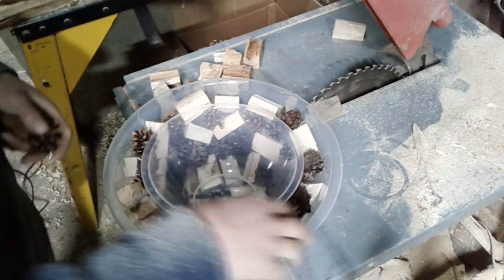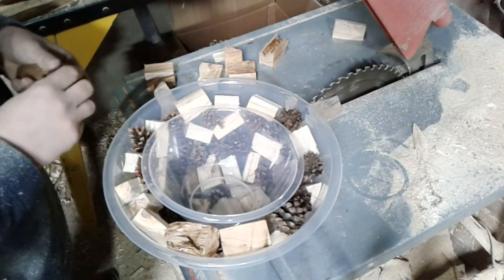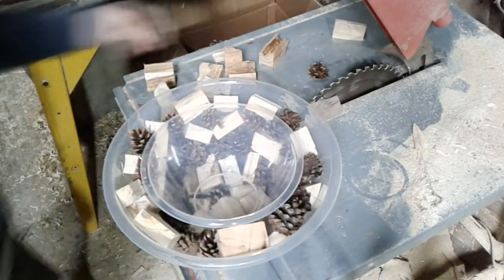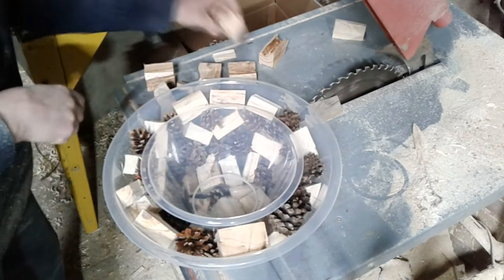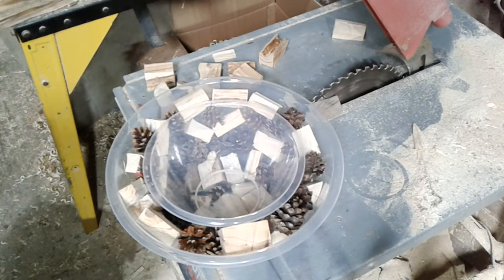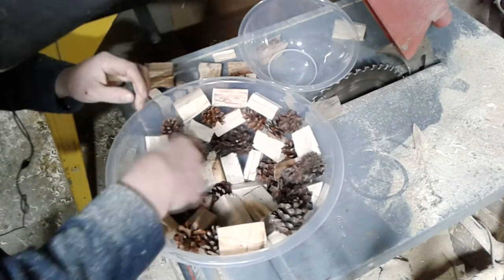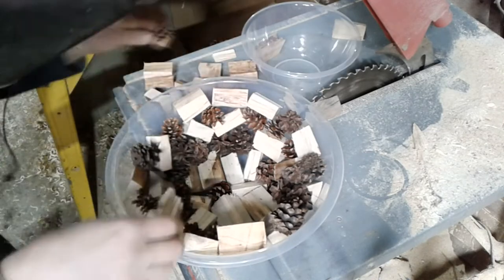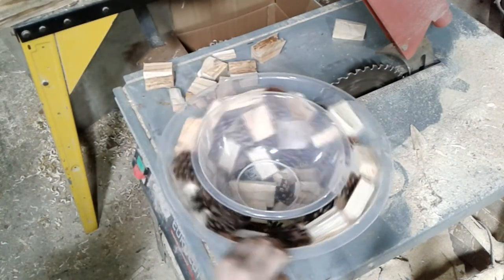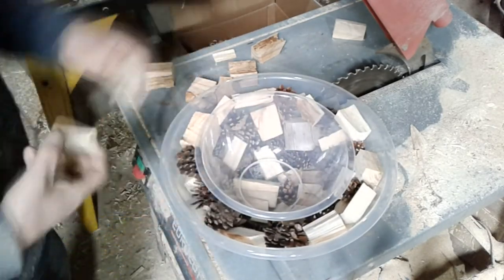There's the 20-centimeter bowl in the middle, just so I don't waste resin. I'm not putting them in any order or pattern — I think when it's turned you should just get a nice natural cross-section of everything in there. I'm doing it thick as well, probably about an inch and a half thickness all round, and I'm hoping to turn that down to about three quarters of an inch.